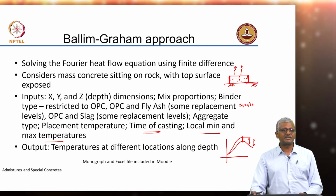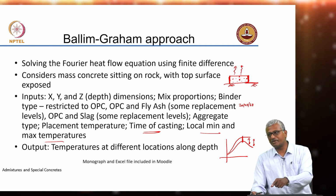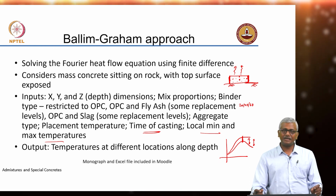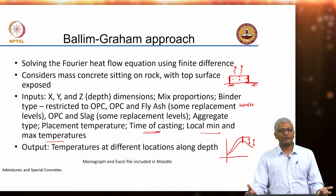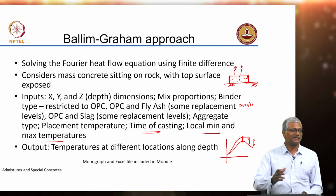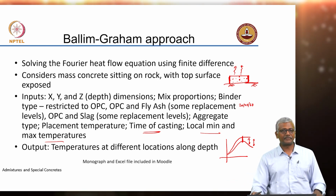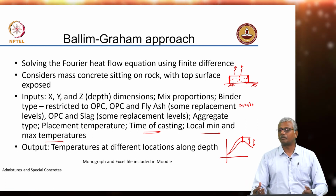So, in such instances, it is very important for us to understand, apart from heat, so we were expecting all the time that heat is going to be the major cause of cracking. So, all the efforts were taken to restrict temperature differential, and indeed there was no random cracking on the surface also seen. But what we were able to see is almost like somebody takes a cake and cuts it into 3, perfect cut happened, just like what you see in pavements or in slabs where you forget to put the construction joints. So, this almost appeared perfectly. Luckily, that was not really a problem in this case.